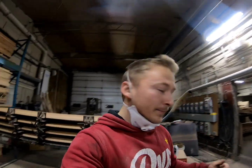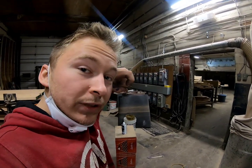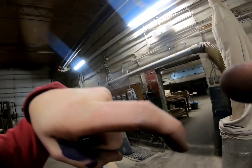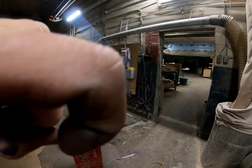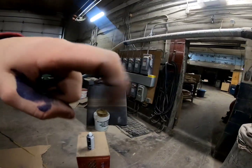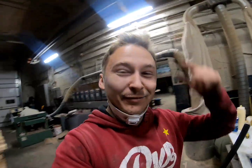It will want to kink because when you bend a pipe it starts out straight then goes curved. The top has to lengthen — this piece on the outside has to stretch. That's why it wants to kink or ripple. The sand holds it from doing that. Anyway, let's get this thing full of sand.